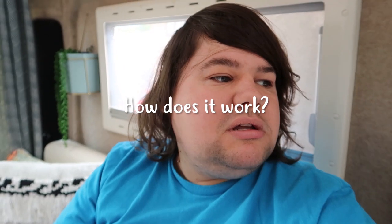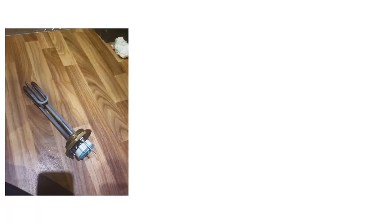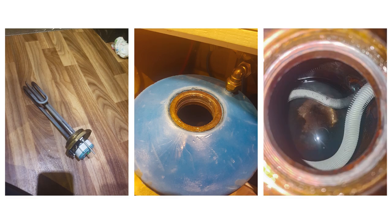How does it work? It's quite a simple system really - basically the same concept as all your other tanked water heaters, be that a gas or diesel system. It's got a 10-litre body of water which fills the tank. There's an immersion coil - a metal pipe inside the cylinder - which screws into the top of the unit. This is where the coolant fluid flows around; the metal pipe has fins on it and dissipates the heat into the water. As the coolant continuously flows around the engine through the calorifier tank through this metal fin system, it heats the water up. It's a very simple system and it wasn't that hard to install.